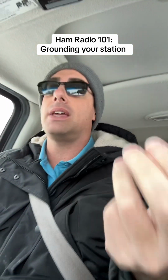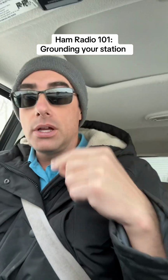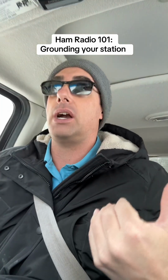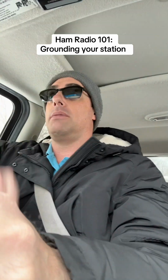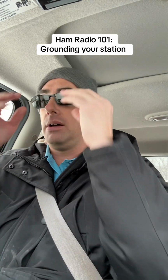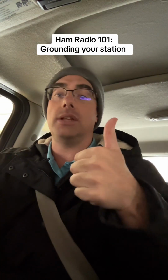As I was bringing stuff in, I had the idea, I need a pass through anyway, so why don't I pass it through a metal plate cover that goes over the plate. That way I can tie them all together into a common ground there as one other common ground point. So that is what I did. So now they are all attached there, including the VHF, UHF. They're also all grounded at the pole because they are with a lightning arrestor. And from there, everything just works together. I have not had grounding issues. I have not had RF burns from the system, and that is awesome.